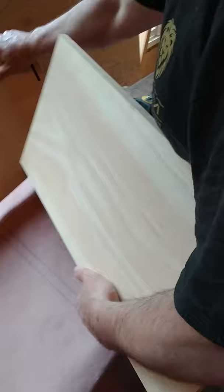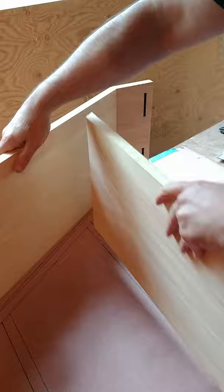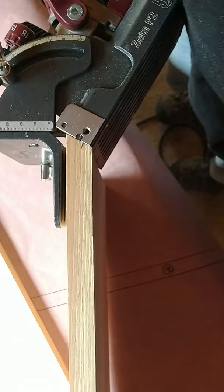We're going to work off the long point on my shelves — this is the part that comes into my upright, so this is my upright, my cord piece, and these are my angled shelves that come in. To do that, we're going to work off the long point. I've set the miter gauge and I'm using a stop square to work from the long point, and I've gotten my miter correct on my piece. Now to get my height correct...